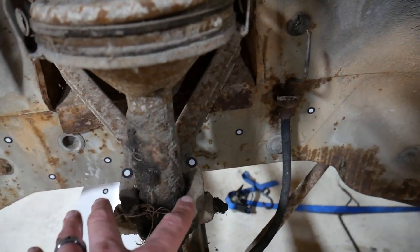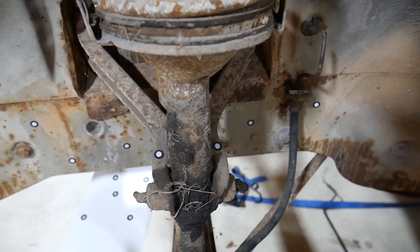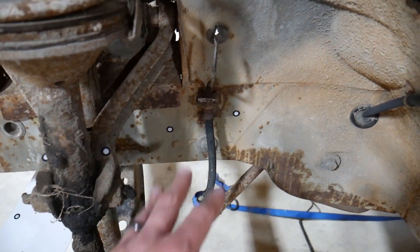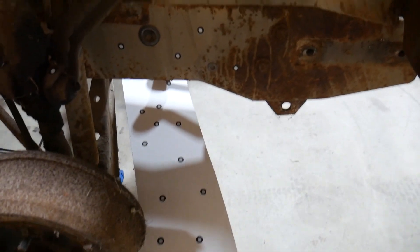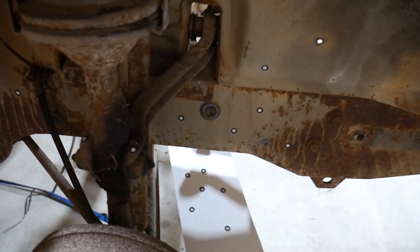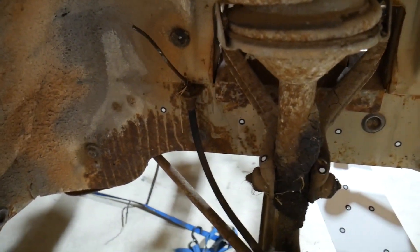You're also going to see these little targets right here. I don't really care about that suspension geometry specifically — what I'm really trying to do is take geometry from over there and tie it into this side as well. On this side of the car I did the exact same thing: brought the poster board up, tied it into geometry there, made sure I capture my structural channels, and used the suspension to jump across to the other side and capture some of the detail there as well.